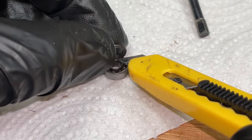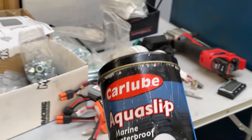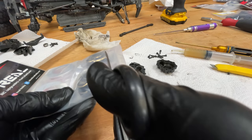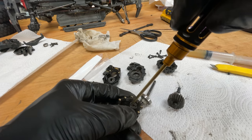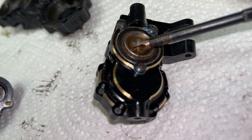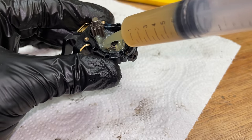While we've got it all apart, I may as well take the bearings apart and make sure there's enough grease in there. I'm using marine grease because it doesn't mix with water. I'm going to fill this right up with grease so hopefully there's no room in there for water to get in — more grease, the better.